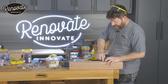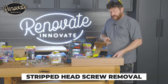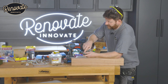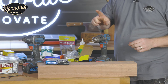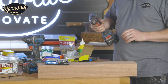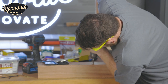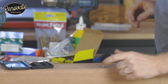So we'll do a little demonstration of how you might be able to get one of these screws out. There are numerous ways, but we've been sent one of these screw extractor kits from Centurion. So here we've got five different screw extractors for different size screws. Find the one that best fits your screw head, place it in your drill on a reverse setting. Select the highest torque setting and the slowest speed in reverse. As it cuts more and more I'm going up the sizes of the bits. And there we go — I definitely recommend these screw extractors, they'll definitely get you out of a messy situation.